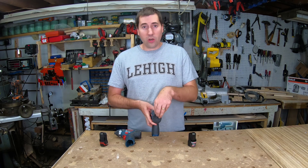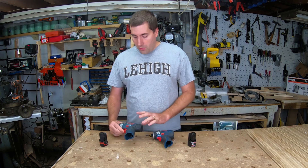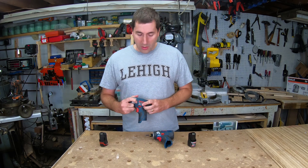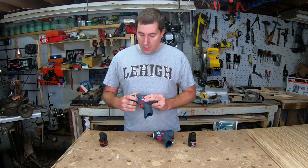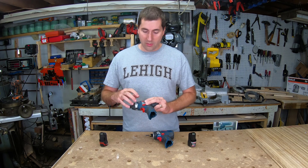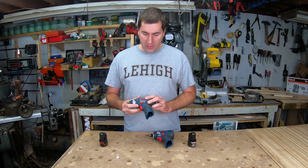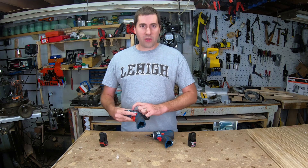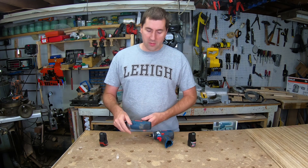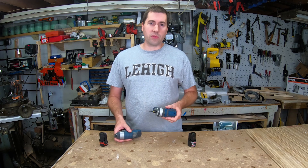The newer tool added a little hook on the end so you can put a lanyard on and drape it off a belt — a nice added feature. One interesting feature on the older tool is rubber bumpers on the side with a screw in the center of each one. The rubber itself appears to be glued on, so the screw connects the plastic directly to the gear housing. That means you have to install screws on both sides and flip the tool over during manufacturing, which increases cost — and it's something they've eliminated on the newer one to make it cheaper to manufacture.